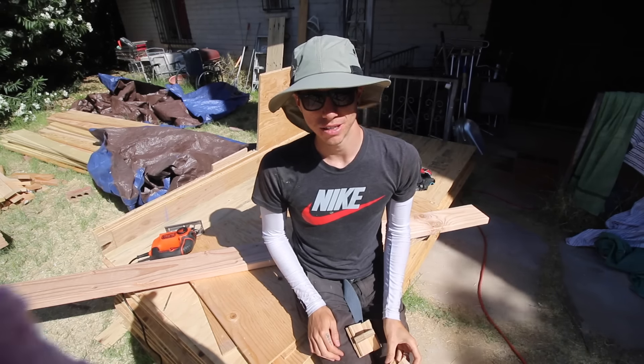I've got all the joists cut to perfection. I'm going to be attaching them to the top plate using these brackets. There are going to be five nails going into the actual roof joist and on the bottom I can get at least four or five nails in there. The nails going into the joist are inch-and-a-half joist hanger nails, and the nails going into the top plate are two-inch nails. I've already got two joists up just to get an idea of how I'm going to do it.